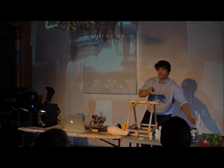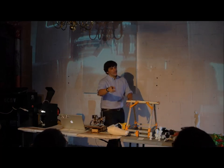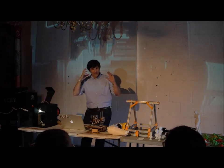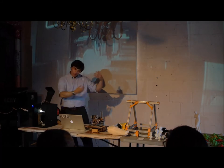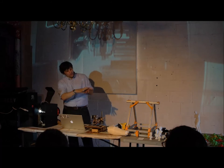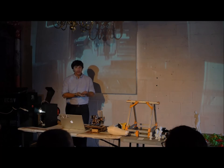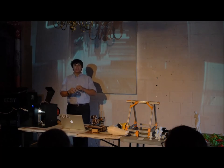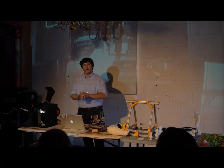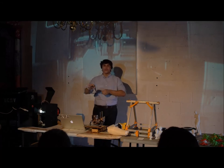Interestingly, you can make homemade circuit boards, but you have to think outside the box. I've played with a 3D printed circuit board that uses conductive thread for wiring — you can wrap prototype boards, and it's basically like a breadboard that you can make instant customizations to. More importantly, you can build it onto an object: if you wanted to make a circuit board inside a box, you would actually make the box with the components inside it already, using conductive thread to wire them together.